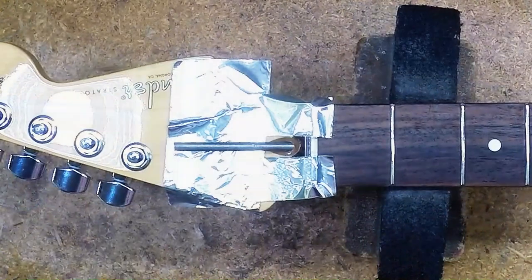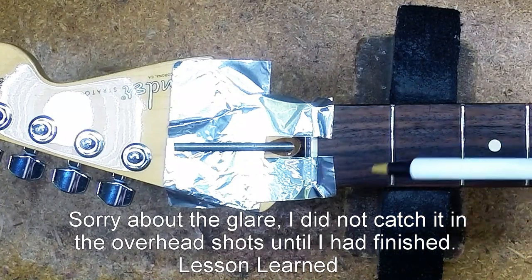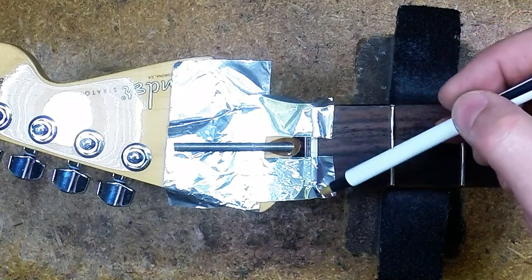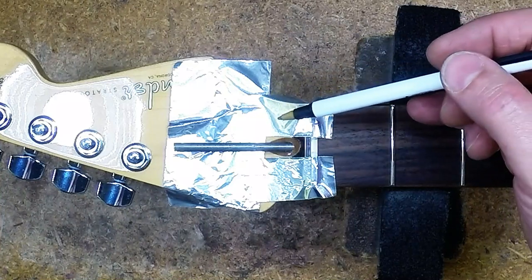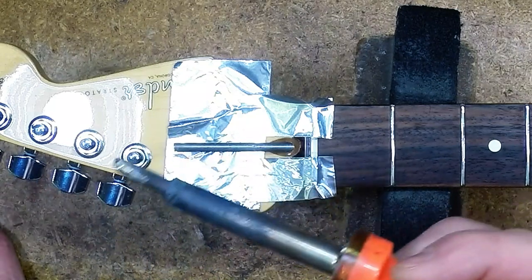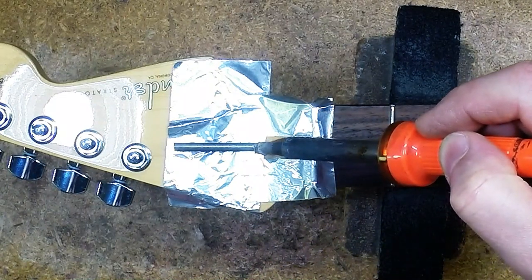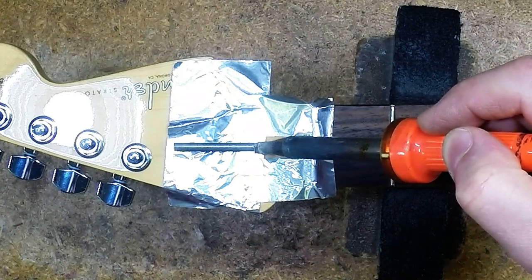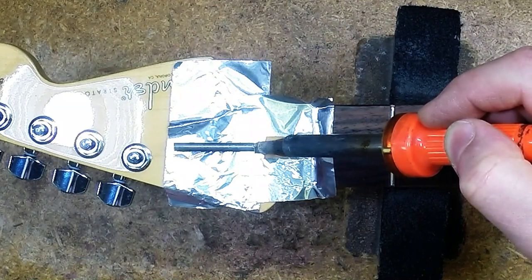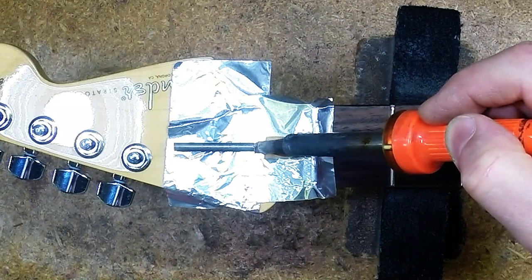So away we go. I've added some loosely adhered aluminum tape here to kind of act as a heat deflector - there shouldn't be that much heat but we're just not going to take any chances. I've got my rod in here, I've got my iron - I'm going to use my little 40-watt Weller here. I'll put a little solder on so it'll heat better, then we're going to start heating. When this gets nice and warm we'll see what happens. If we're not lucky I'm going to have to resort to heavier tools like easy-outs and screw extractors to get this nut out.